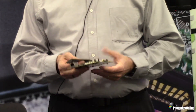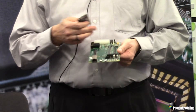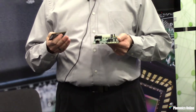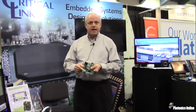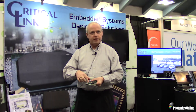The way that you use a SOM is you basically design what we call a baseboard. The baseboard contains all of the personality — the hardware personality for your application — and then at production time you take the SOM, snap it into the connector, and then many times we will screw it down or there'll be locking tabs here to hold it close to the board.